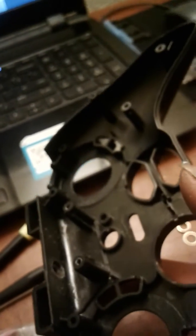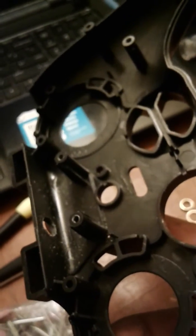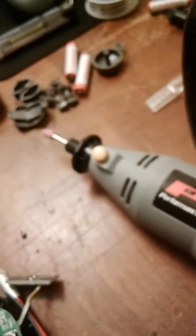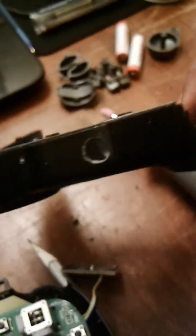I exposed the signal wire and then worked on the controller. Since the cable goes in here and I want the antenna coming from the top, the best way is to work on the front plate. Your standoffs give you the height — the room you have to work with. When it sits on the controller, the standoffs open up that space so the antenna has room to go through. I drilled a hole using a small drill bit and opened it up until I had enough space to pull the antenna through.